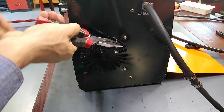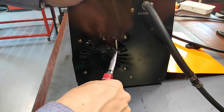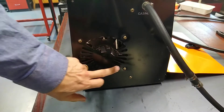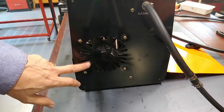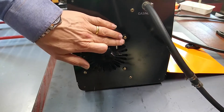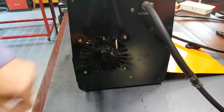What's going on here is I'm cutting away the cover from the fan area — I reckon it impedes airflow too much. There's only a series of sort of grooves or slots and I think it's too restrictive, so I'm just going to cut it all out and replace it with a finger guard. Finger guards are far more free-flowing. It looks a bit brutal and rough, but doing this with an angle grinder or a jigsaw is out of the question.